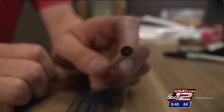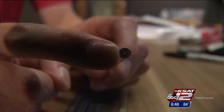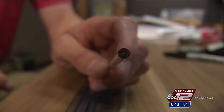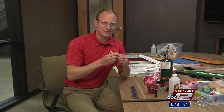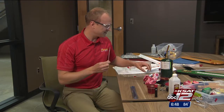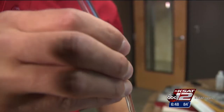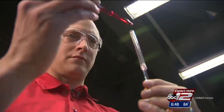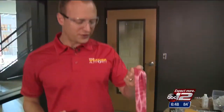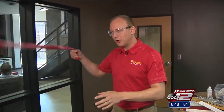Getting the colored alcohol down the thermometer is a little more complicated than it sounds, because we're working with a half millimeter diameter bore running the length of the tubing. Because it's so narrow, you can't just squirt the alcohol down the tubing. In turn, we use physics and a tube sock. I take plastic tubing and put it on the top of the thermometer, then use my eyedropper to put the alcohol into the plastic tubing. Now I need to swing the tube sock and thermometer rapidly in order for the centrifugal force to push the alcohol all the way down to the bottom of the thermometer.